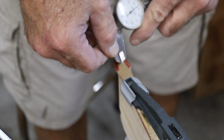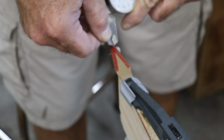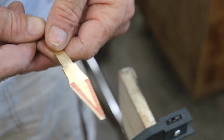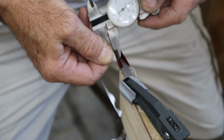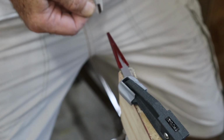I cut, ground, and filed the brass and steel bolsters the same way I did the blades, so I'll spare you the deja vu. No need to watch me file metal again unless you're really into that sort of thing. That said, the top edges get a slightly different treatment. For the brass bolsters, the bevel is just a light chamfer, about a 32nd of an inch, since the material is only a 1/16 of an inch thick.